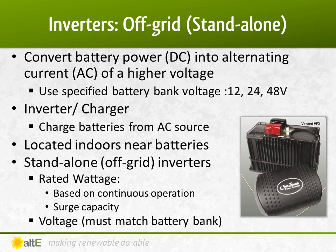When selecting an inverter, you must determine what your maximum wattage draw will be if all your appliances that may be on at the same time are on. If you have an 800-watt well pump, a 100-watt fridge, five 10-watt lights, and a 50-watt laptop, you'll need to add the wattages together to get at least a 1,000-watt inverter. You also have to make sure the inverter is able to handle the surge as motors turn on — if your fridge and well pump both turned on at once, the surge could be three times the rated wattage. Inverters are rated in both the continuous wattage and the surge capability. Additionally, you need to select the battery bank size and buy the inverter to match. Inverter voltage is not field selectable — they are either 12-volt, 24-volt, or 48-volt; they cannot do all of them, just one.